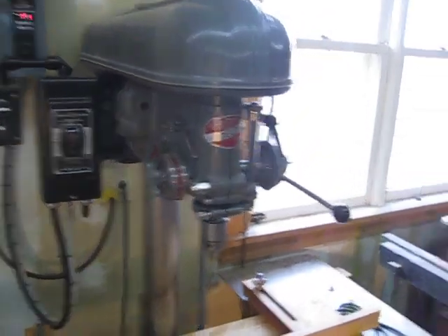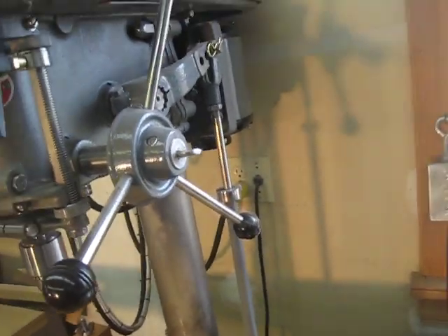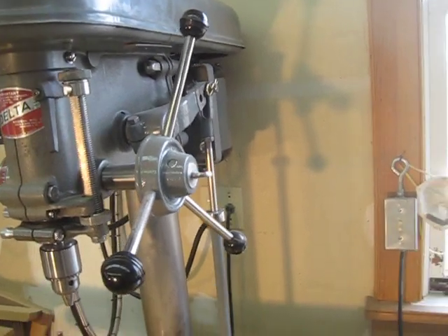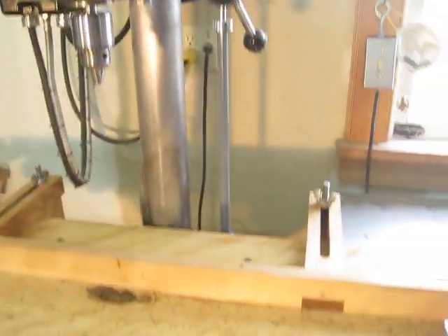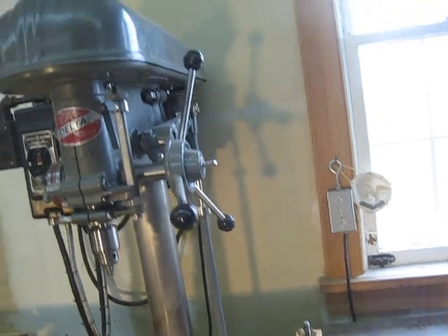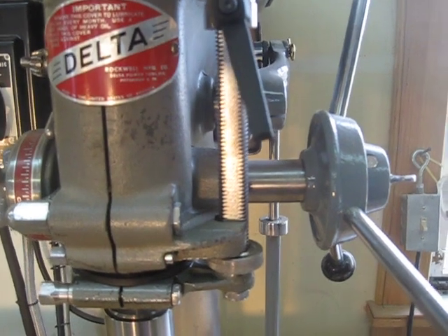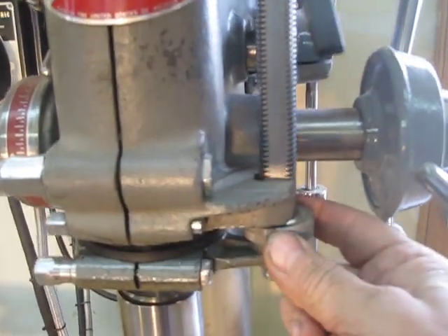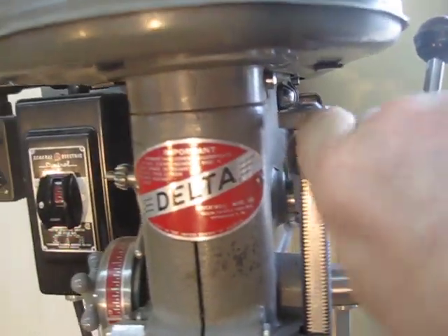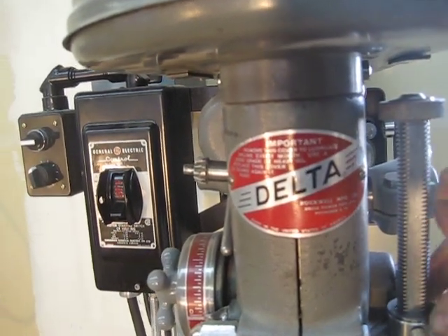This particular press is probably one of the greatest American presses made from the forties. It has the foot feed, which is a really nice feature — special order. I did do some modifications, particularly the depth stop. What I did is this knurled nut here, which is placed underneath — they're generally placed together here with this wash nut and lock washer between them.